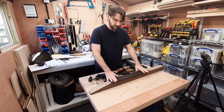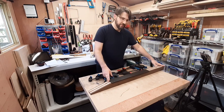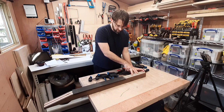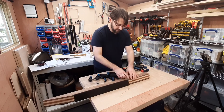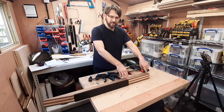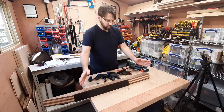Once the fretboard is radiused and I'm happy with that, then I can worry about the position or the height of the nut, and then I can cut away the section for the body. In the body there's going to be a pickup, a gap, a pickup, a bridge, and pretty much that'll be everything. So a lot of that's going to be removed. I'm going to cut away under there to leave enough height for the fretboard, a very slight angle. It's not like a tunematic that needs a great big swooping angle dip down for the neck. It's only a half a degree that I need to cut out there between the fretboard and the bridge.